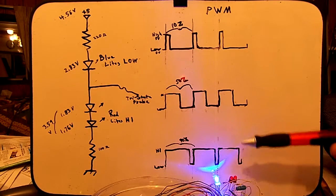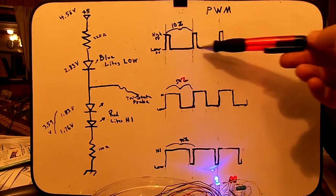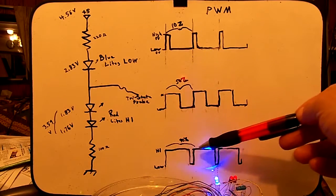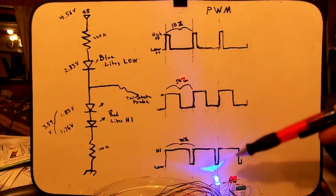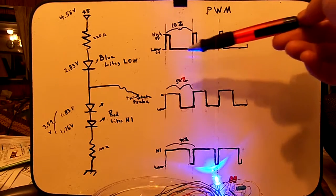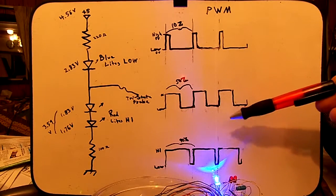Okay, so Fade works by varying the duty cycle of the LED. So it's dim at maybe 10% duty cycle. At 50% duty cycle, it's pretty bright. It's probably almost full brightness. And then you can modulate it like 90% duty cycle if you wanted. And pulse width modulation is done at a certain frequency. So the frequency doesn't change, but the width of the pulses change, giving you more or less power through. And they're using it a lot to control lights and motors too. So it's very popular. Anyway, at 50%, I could make both LEDs look like they're both on, at least to the human eye.